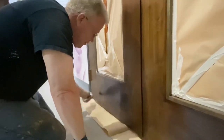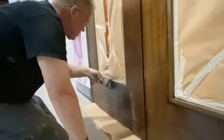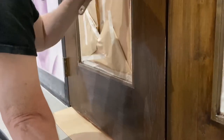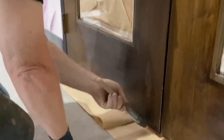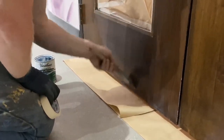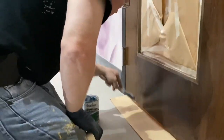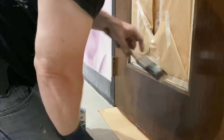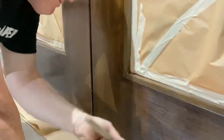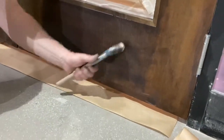I put the cheesecloth in the center of the door — center meaning from top to bottom, I start at the center. Then I quickly go up and down because my cheesecloth is very saturated at this point. After I disperse that volume of liquid, I then go up and down in the direction of the grain of the maple veneer, laying the stain out equally so no part is too light or too dark — it's all uniform. You must continue; you cannot stop when you're staining. You have to finish at least the panel on which you're working, because very often if you try to do just one panel, the stain bleeds into the next panel.